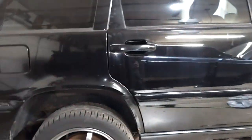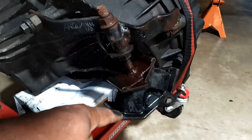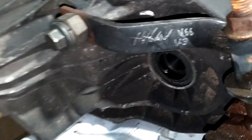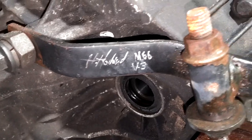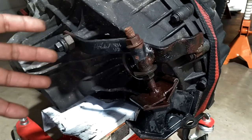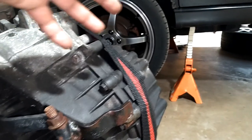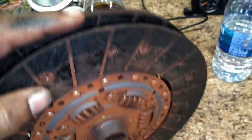When you're installing an M66 — whether it's front or all-wheel drive in these P80 cars — you need a special mount back here. If you don't have that special mount, you'll have to fabricate a bracket. Somebody named 'Hauling Version 3' welded one up and bolted it on the transmission so you could have a rear driver's-side engine mount, because on these all-wheel drives the angle gear doesn't have the rear hydraulic mount that mounts to the steering rack.